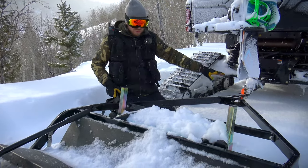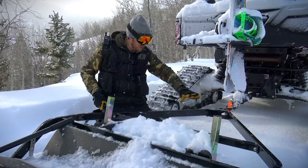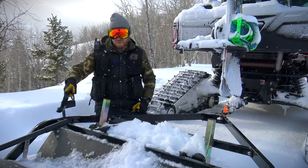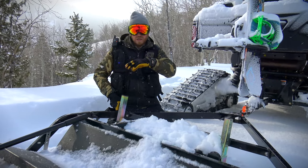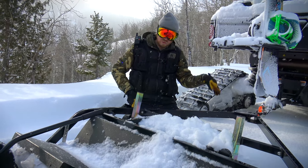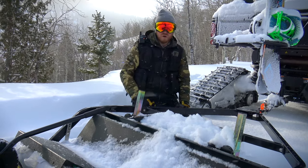We're trying to get the draw bars as level as possible. That's the first step — make sure you are as level as possible with your draw bars, because if they're too high up, you're going to mess up your grooming and you're putting too much pressure on the back of the snow groomer, and you can get what they call a bounce or a little bit of chatter. Or if you're too low, same thing — you won't groom and won't put any weight on the back because your front chassis is going too far forward.